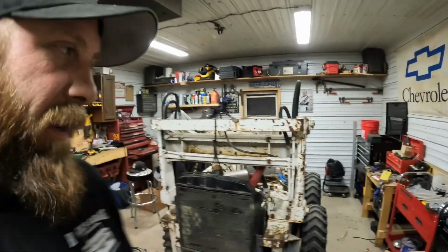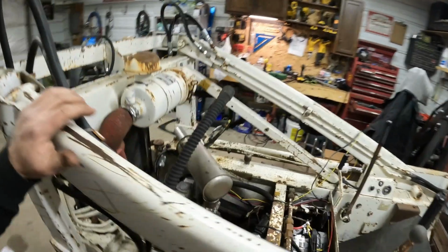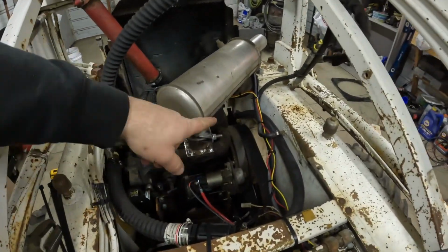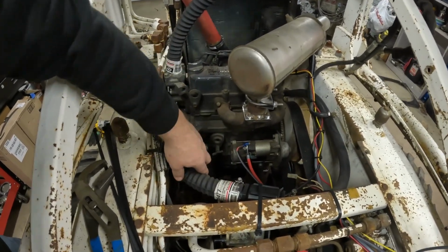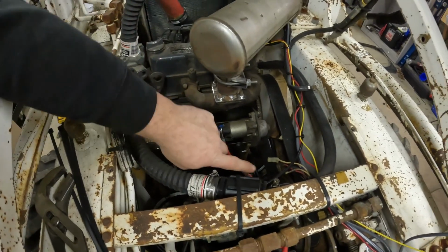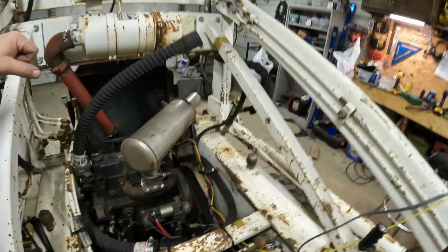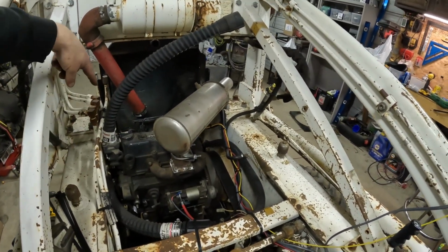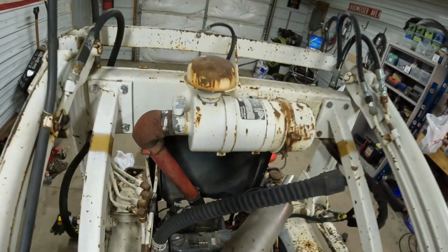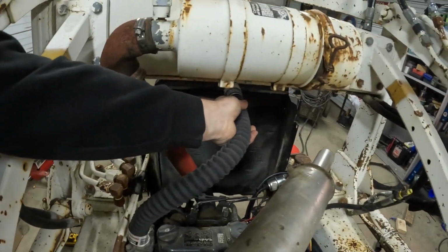So it's time to mount the radiator. I got her hung up there with zip ties right now. I did get the water pump mounted. And we got a radiator hose inlet going into the engine. I cheaped out on buying the brass barb fittings and bought some of these plastic water fittings. So I don't know what temperature they're good for, but hopefully they don't melt. But got that ran and secured down to the water pump, so all we really got left is from the water pump suction side into the bottom of the radiator. And then of course the top one will go on like so.